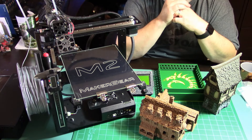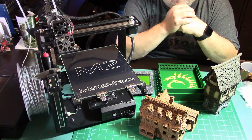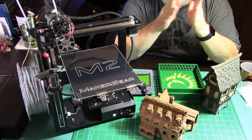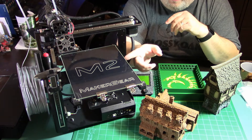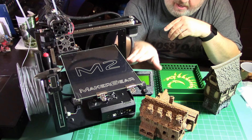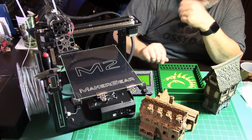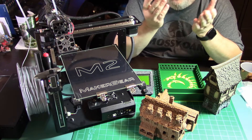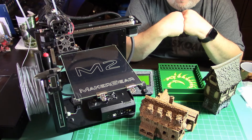Get a second piece of glass - less than 30 dollars. I have three pieces of borosilicate glass that comes right from MakerGear, so I know it's the right stuff. Probably the biggest single tip I can give you for using this printer: never pull a print off the build plate while the plate is still on the printer. I have not had to level my print bed in five months - every time the print ends I unclick the clips, take the piece of glass off, put the next piece of glass on, and let this other piece cool.